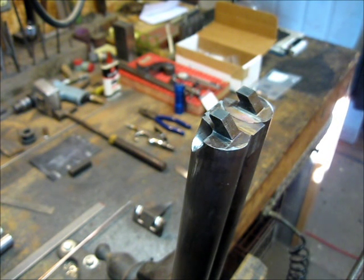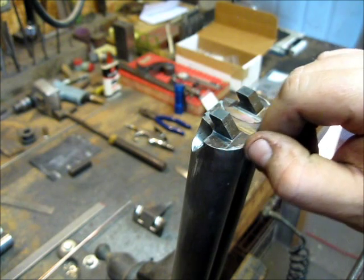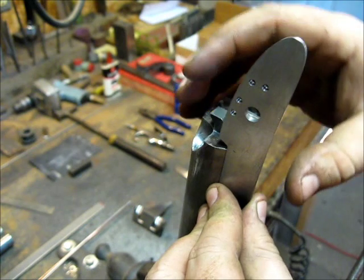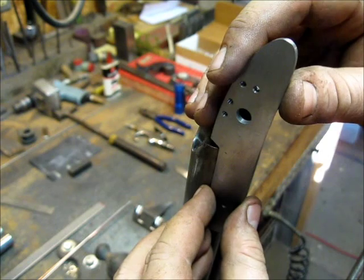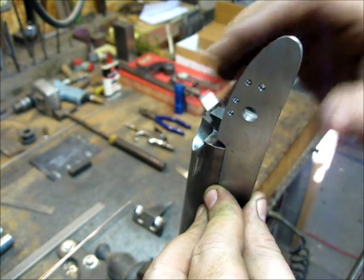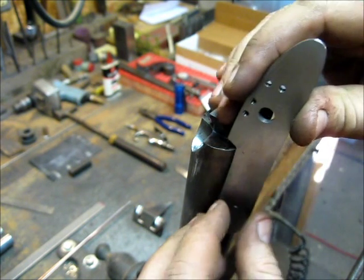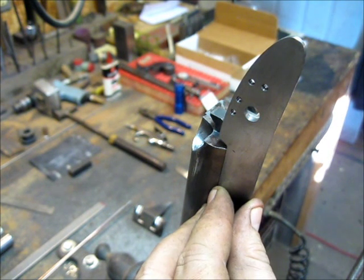Usually on smaller bore rifles you'll almost always see a drip bar on them. That was classic on a smaller bore. On big bores though, where you've got that extra gap in the radius, it was done this way sometimes to keep a narrower wrist. So either one is historically correct, and this gun certainly could have been done with a drip bar, but in order to keep it slimmer and a nicer looking package and get the transitions to look a little cleaner, I went ahead and modified the lock, and I'll do that with all the other locks so that they fit nice and snug underneath the radius like that with no drip bar.